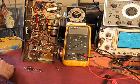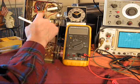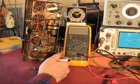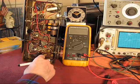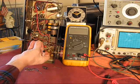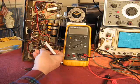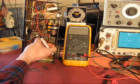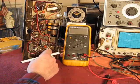Now, usually in these, the absolute value of the resistors is not critical. It can vary all over the place. The radio will still function reasonably well. It's why they put these cheap 20% tolerance resistors in there. It doesn't matter a whole lot. This is 22K, 20%. So who cares if it's 15K or 30K? It's where it is in circuit. It's going to work just fine.